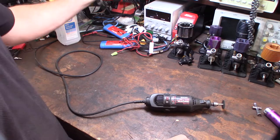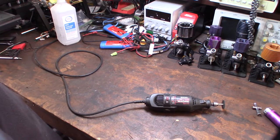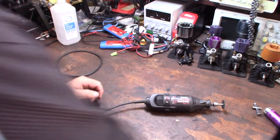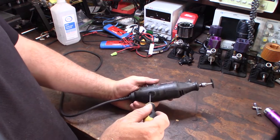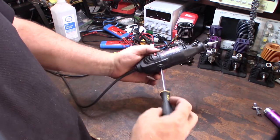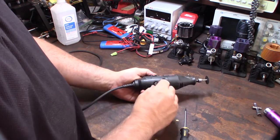So now I'm going to unplug it. You should always check the obvious things first. All of the obvious things would be like the brushes. I'm suspecting it's probably the switch, but let's look at the brushes.